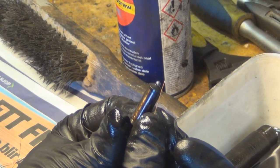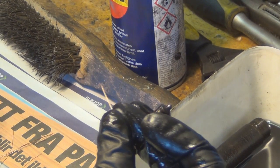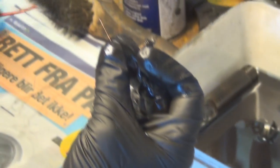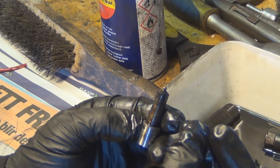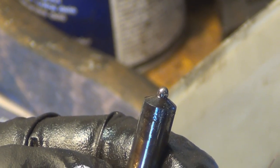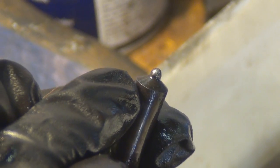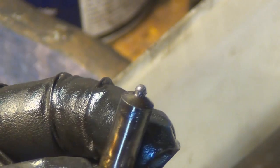The easiest way of cleaning them is with just some copper wire, which we've stripped from an ordinary bit of wire. I think the manual says 0.25 millimeter wire. Right, now I'm zooming in really, really close. I'm something like an inch away now. And what you need to do is look around the nozzle. You can see the holes, and you'll find the holes.